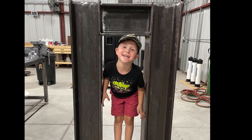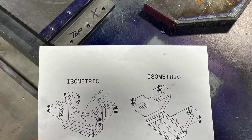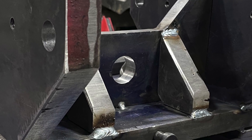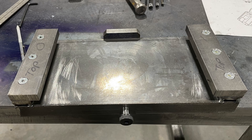He's what I like to call a maker in the making. It's time to cut out some parts. Most of this material is one inch or three-quarter inch mild steel. I use annular cutters to do a lot of the hole drilling to help speed things up. Now the upper die assembly is tacked together and the lower die assembly is tacked together and ready to fit up.